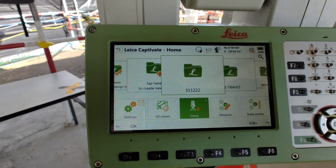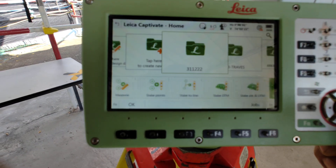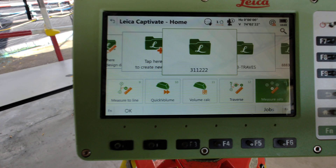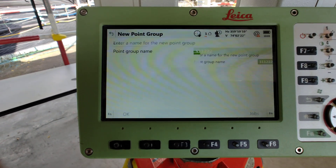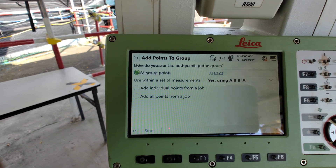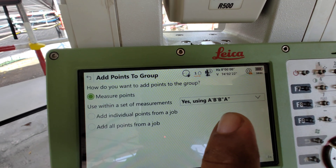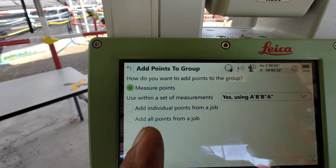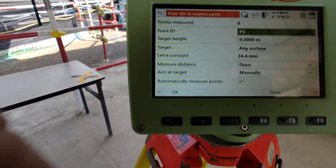After that we need to go to another option. This option name is Measure Sets. Press Measure Sets. Enter the group name and the date. Then you can see here: Measure Point — we said instrument using A-B-B-A. Yes. Then Add Individual Point — from a job: No. Add All Points From a Job: No — so this one we will not select. Just press okay. Now points are coming: point number three.